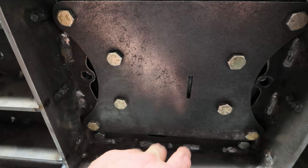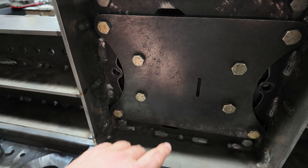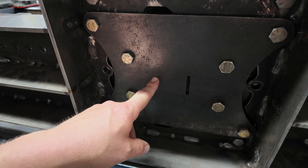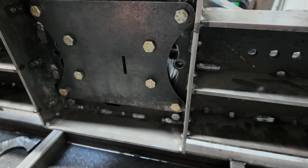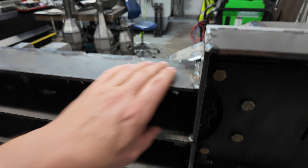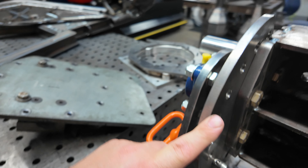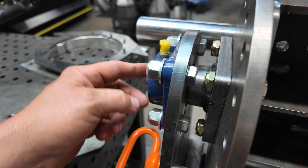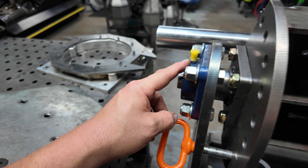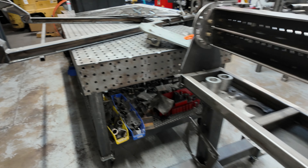This pinion center piece is removable — it holds the two pillow blocks on the inside that the bar slides through. You can take the bar out, take this bracket out, and get inside, because this face is open so you can weld the inside. It makes it really easy to assemble. The exterior flange is half-inch and bolts into this rotating piece. I machine these inner pivots, got this pillow block bearing from McMaster-Carr, and this thing actually rolls really easy.